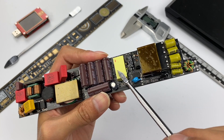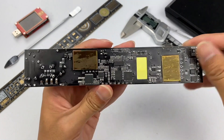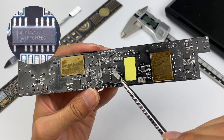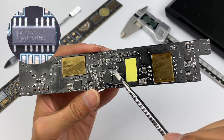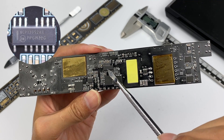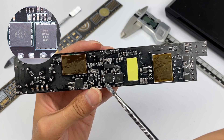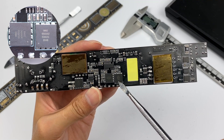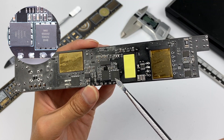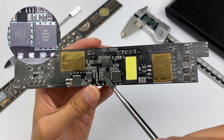This inductor is the resonant inductor in the LLC architecture, and the big one is the main transformer. The master control chip of the LLC power supply is ON Semiconductor's NCP13992, a high-performance current-mode controller for half-bridge resonant converters, implementing 600V gate drivers. There is a half-bridge composed of two InnoScience GaN components responsible for LLC resonant switching — module INN650D02, with a 650V withstand voltage and 200mΩ on-resistance. The GaN components here further reduce the switching loss of the LLC topology. Here are also three LLC resonant capacitors.